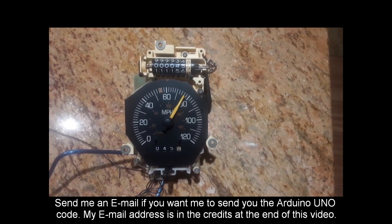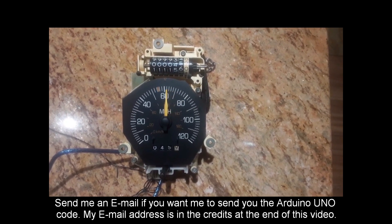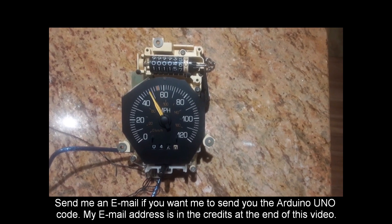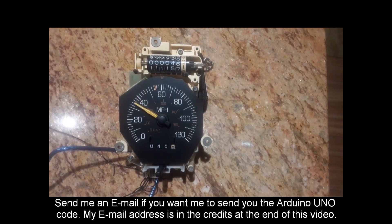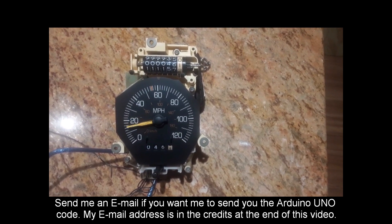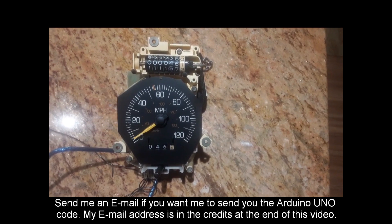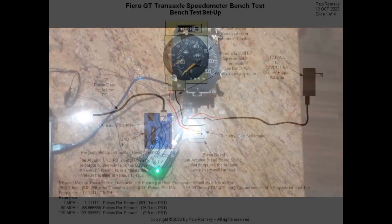Right after this quick little video I'll have three slides that tell you how to hook it up. It's a quick way to check it. And if you set the 60 mile per hour compile-time switch flag to a one in the code and recompile, this will output a signal for exactly 60 miles per hour so you can calibrate to that one speed. It gets a little jittery — that's just because of the control loop, delays, and interrupts. And there's the Arduino. So let's go on to the slides.